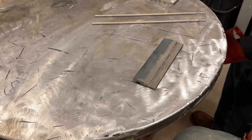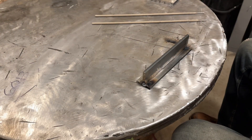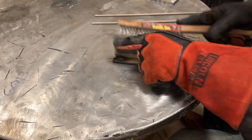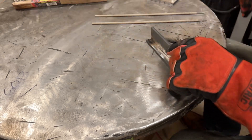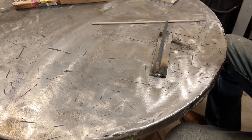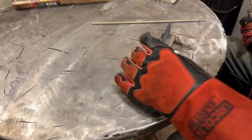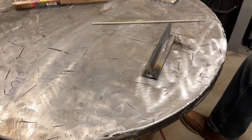Since I have a 6010 here, 130 amps should be enough to tack this. An old welder's trick was to dip 6010 in water, crank your welder up to about 250 amps, and you could literally use a 6010 to cut a plate in half. I'll have to shoot a video where I try that — I've never actually done it, but I've heard it works from reliable sources.